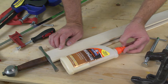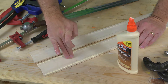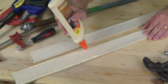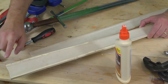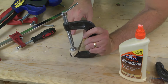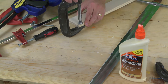We want to make sure the sides have no gap when you close it up. If it's good, you're ready to glue those two sides together using Elmer's wood glue — easy cleanup with water. Make sure that if it does spill, it's spilling outward not inward. Don't use too much. Rub the bead with your finger to make sure it's fully coated with at least a little bit of wood glue. Just a little bit does the trick. Since we're going to clamp this down we really don't need a lot — it'll bond very, very tight. My experience with this wood glue is great; it's basically an industry standard.